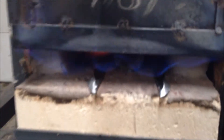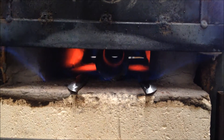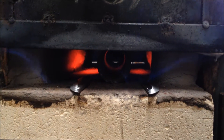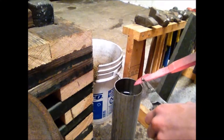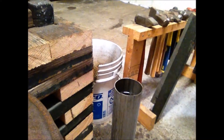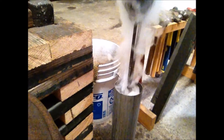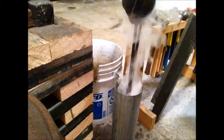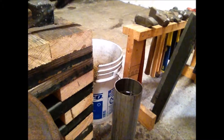The grinding is all done, so it's time to harden the knives. We have a pipe there in the forge that helps disperse the heat, so that while the knives are in there, the edges don't overheat, and they heat up more evenly and slowly. For the hardening, we bring the knives to just past magnetic — you can see I'm tapping it there with a magnet. Heat it up until it's just past magnetic, and then quench it quickly, in this case in vegetable oil. It hardens the knife and makes it very brittle. That's the first step of the heat treatment operation.